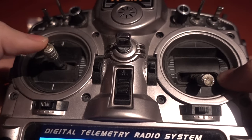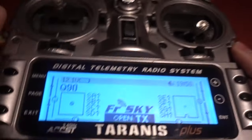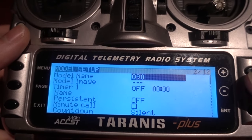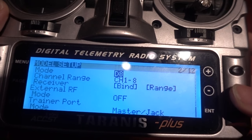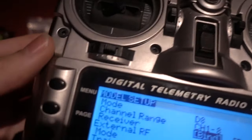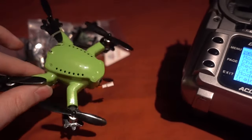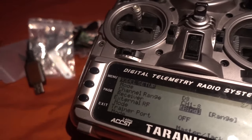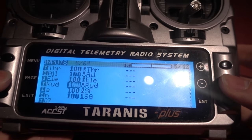I've set up my Taranis with a model. Out of the box it's set up to arm on the rudder with auxiliary one or channel five set up as the modes. I've changed mine so it also arms off a switch. Named it Q19, set to D8 mode, and after about six seconds it goes into bind mode. You have to be pretty quick getting both devices ready together, otherwise it'll look like it's not binding.